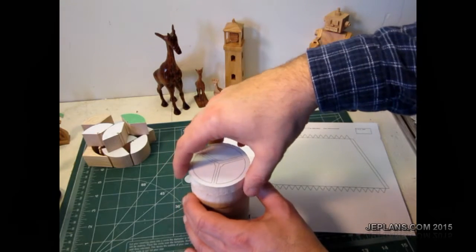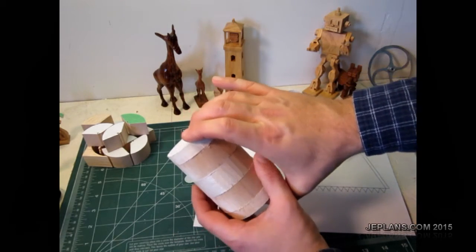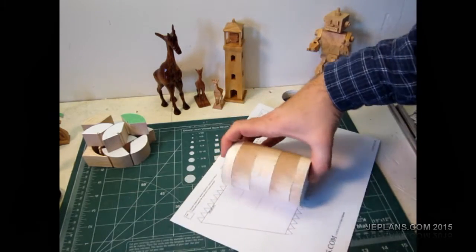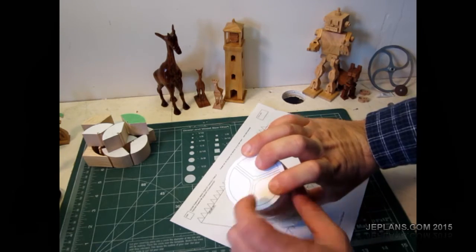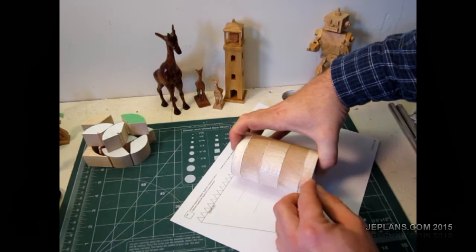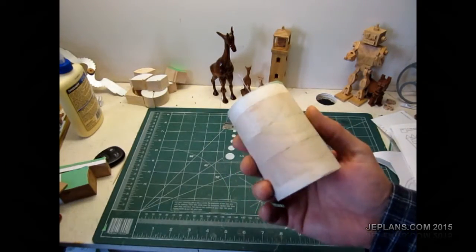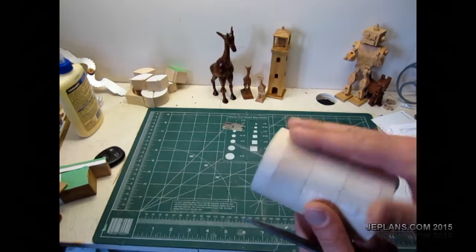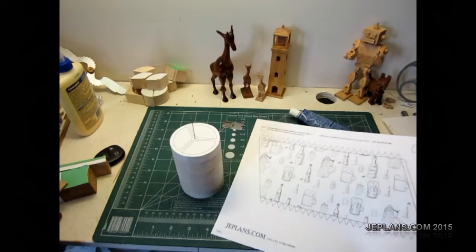For the gluing, I'm just going to use wood glue. It's not overly heat tolerant, but balsa is a pretty good insulator so I don't think it's going to be an issue — the glue itself shouldn't get too hot. That's going to come out a hair taller than my plan. Once I have it all glued together, I drill my hole for the music wire of the displacer shaft, then just cut off the bottom to the right height. I've sanded it off and my intent is to put a small thin layer of silicone all the way around it, then wrap it with cotton paper to make it look a little nicer. Bake it up and see how it turns out.